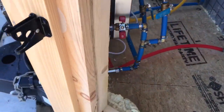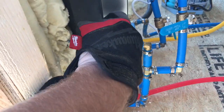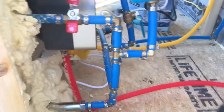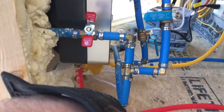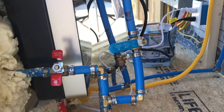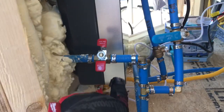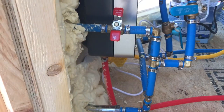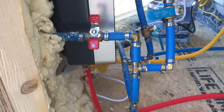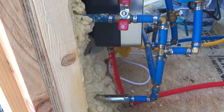First off we have our hose bib coming in — the water coming into the house, which is right here. When you turn that valve on and let water flow in, it will feed all the lines in the house. This ball valve lets water go up to the whole tank and also primes the pump. This other hose line comes back down, tying back in past the beginning of the PEX, letting water join into the system and pump from the pump only — not from the city. You'd turn the city off, or if you don't have city water just leave that ball valve off.